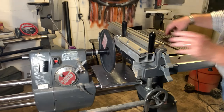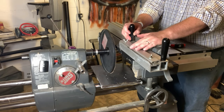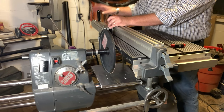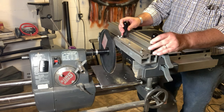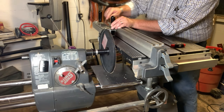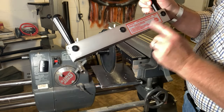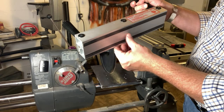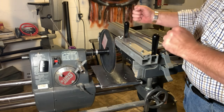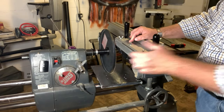I'll stand off the back side of this machine — we're at the right-hand end. We always start at the front end of the fence and slide this all the way across, keeping everything firmly in place against the fence and against the table. There is a point where we run completely off the fence, right about here, and I should be clear of the blades at that point. We've got nylon glides running against the fence and glide strips on the back running on the bottom for smooth movement. We must not let it drop off, lift it, or roll it — just keep it against the corner of the fence and table.